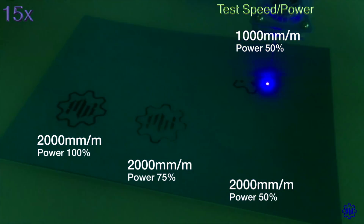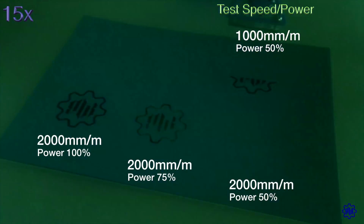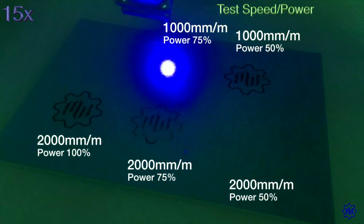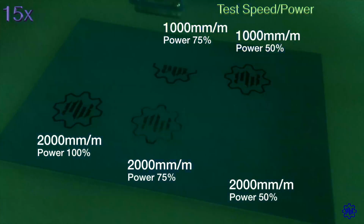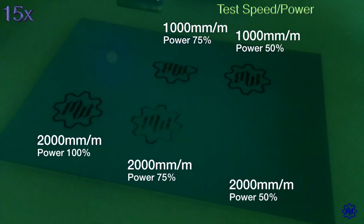The first has double the power of the laser, but was used at double the speed of movement, achieving the same results. So, for those who have a low wattage laser engraver, do not despair, just lower the speed of movement, and you will get the same results I have. Isn't patience the virtue of the strong?